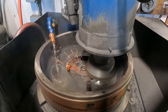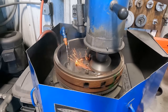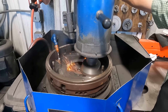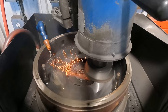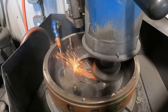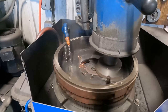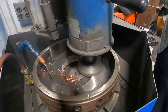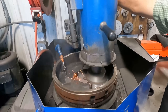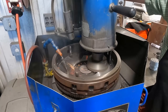As we've continued to grind, you can start to see those areas of uneven wear showing on the surface of the flywheel. This is what we were discussing, and when we're done resurfacing the flywheel the surface will be completely flat, ready to mate perfectly with the new clutch. We continue to grind, feeding the CBN grinding wheel gradually until we see that no signs of wear are left. At that point, we allow the grinding wheel to spark out before moving onto the second surface.